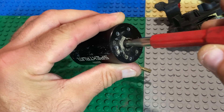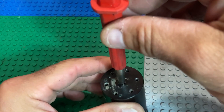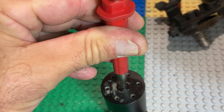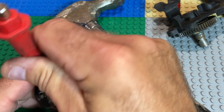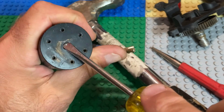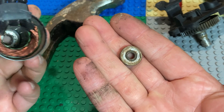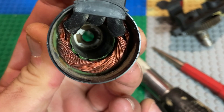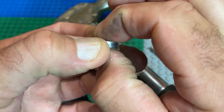The inner race diameter is slightly smaller than the diameter of the hole on the face end of the motor. So I just take this tapered punch, give it a few whacks with a hammer, and beat it like it owes you money. It might get a little stuck, so grab a flat tool and you'll be able to pop that bearing out. Be careful not to score the inside of the motor. There's some dirt and mud in there — you can clean that any way you wish; I'd just scrape it rather than spray much in there.